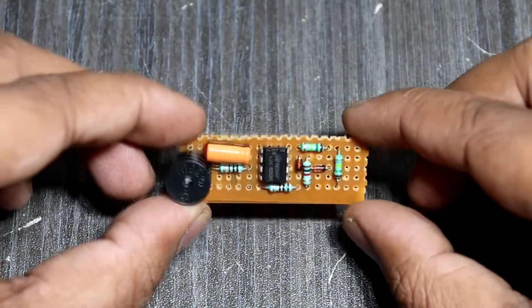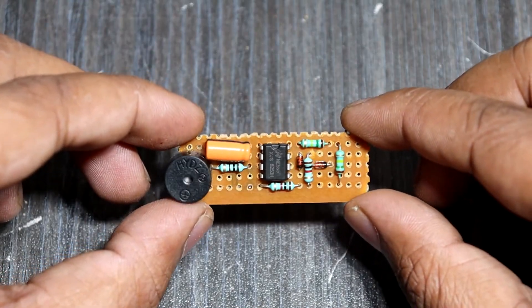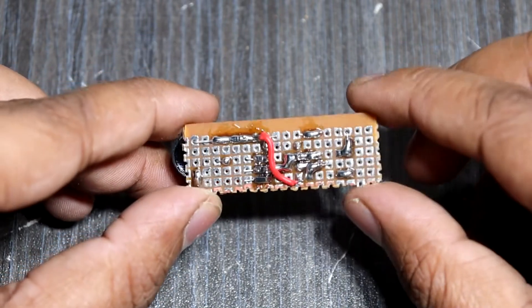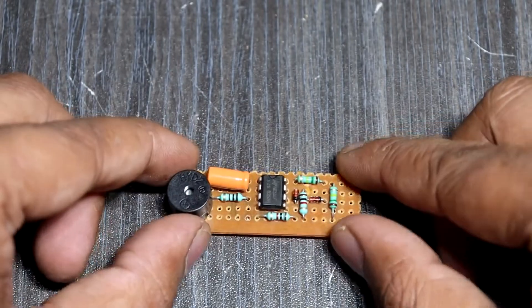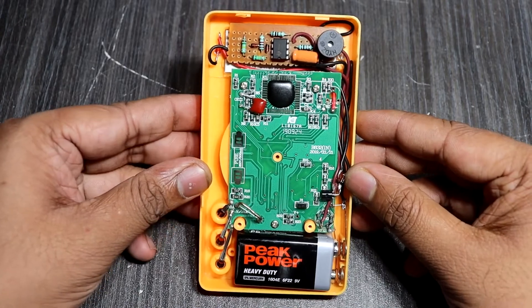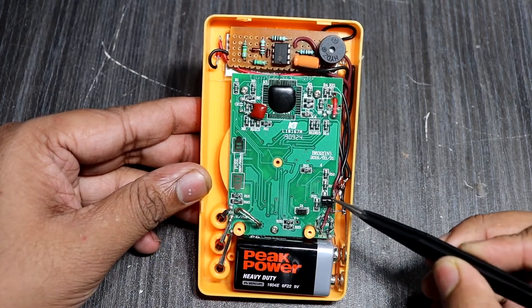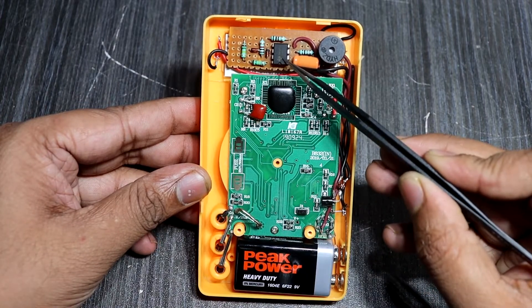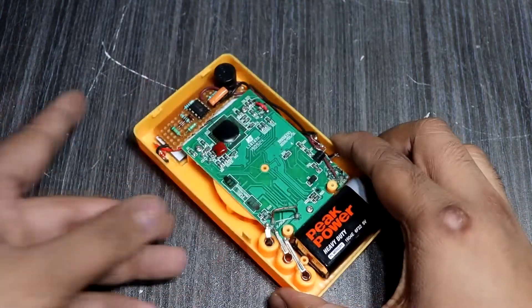This is the circuit I am going to use in this multimeter. This single buzzer will work both as the continuity testing sound and as the every-20-seconds reminder sound. After a while I finished setting up the circuit on this multimeter — including the switching transistor and the Timer IC555 circuit. Everything was successfully placed. Now I will close the multimeter.